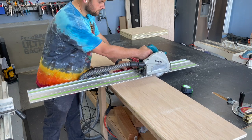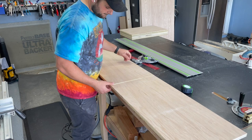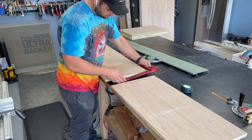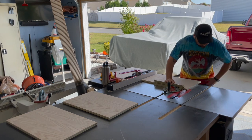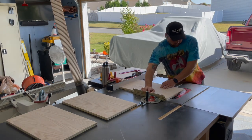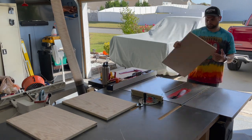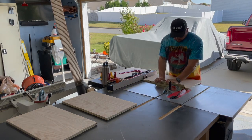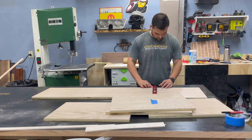I did this cut in two passes — an initial scoring cut just to break the surface, and then a full depth pass. This really minimizes tear-out. Once everything was cut, I made sure it was square and then fine-tuned my pieces over at the table saw. Right now I'm making my sides and then my interior dividers for the cabinet, cleaning up all those edges and cutting everything down to final dimension.